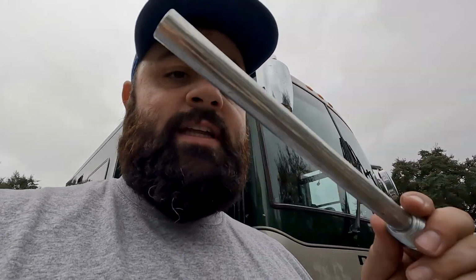So we're gonna go ahead and put this new one in. This one is actually an aluminum one. There's aluminum and there's magnesium ones. And the advantage of aluminum is if you're in an area with a lot of hard water, such as Florida, the magnesium can react with the hard water and cause a sulfur smell, whereas the aluminum does not have that downside. So that's why this client decided to go with aluminum over magnesium. So I'm gonna go ahead and get this installed, get the hot water heater fired back up, and should be good.